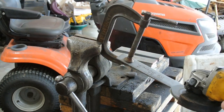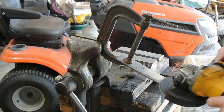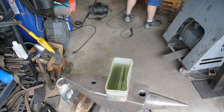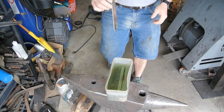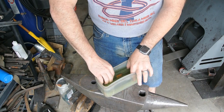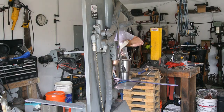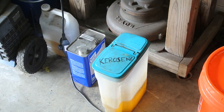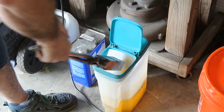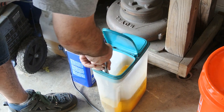I used about 16 layers of this so it took a little while. I'm only going to show you a little bit of the stuff that I did, just kind of the highlights. Clean it up in some acetone. Now that it's clean, let's go ahead and weld her up. I'll try to hide the sparks from you so that you didn't get blinded or anything. Dip in a little bit of kerosene just before we put it into the forge — it helps to burn out any oxygen between the layers, supposedly.